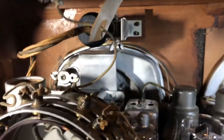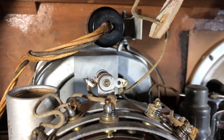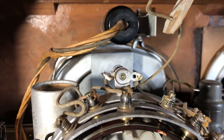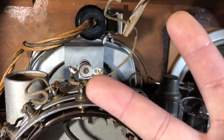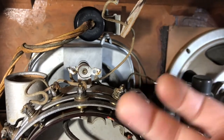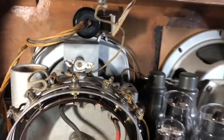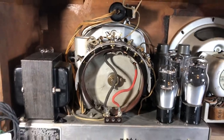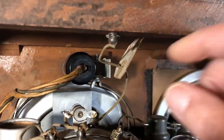There's also a magic eye tube. A lot of radio collectors really like this because when you tune in a station, the eye glows green. As the frequency changes, the glowing piece comes together once a station comes into tune. That was the purpose of those tubes — it's more of an aesthetic tube than anything.